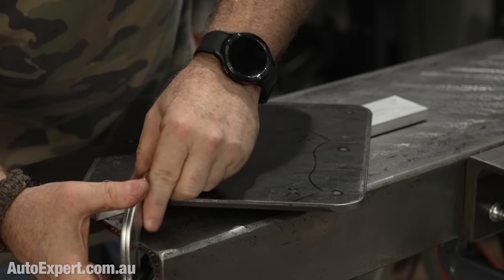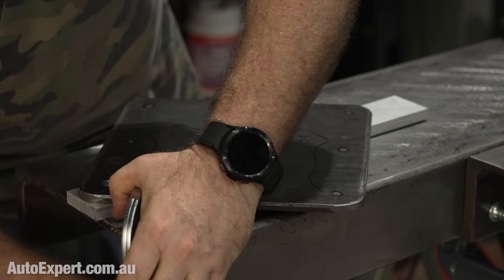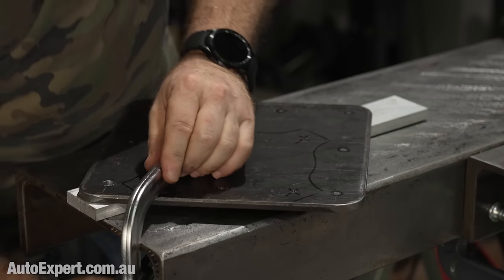The bar under the plate is a piece of aluminium stock — just an off-cut. It stops the weld metal from falling straight through like a big drip. It helps it freeze fast because aluminium is an excellent conductor, like a heatsink. And it stops me from welding the plate to the table, which is kind of a neat trick. If you are ever as dumb as me and make a mistake like that, remember the aluminium trick for filling up holes, because it's awesome.